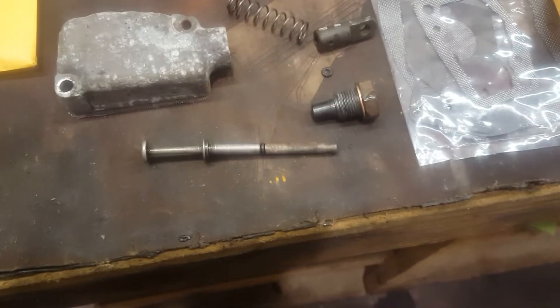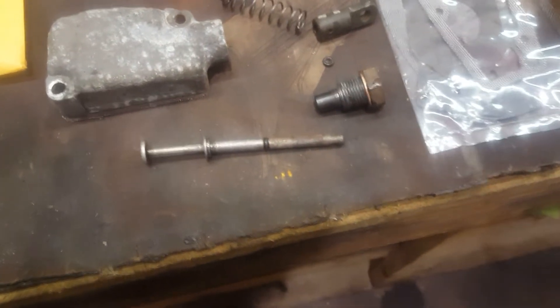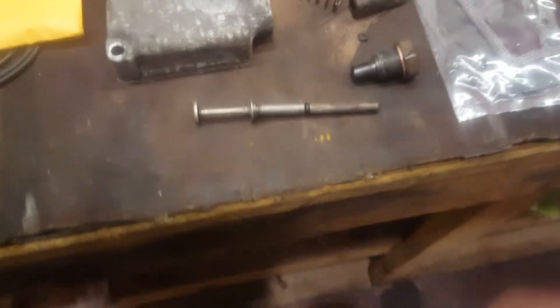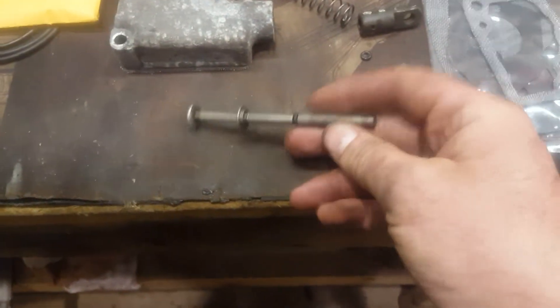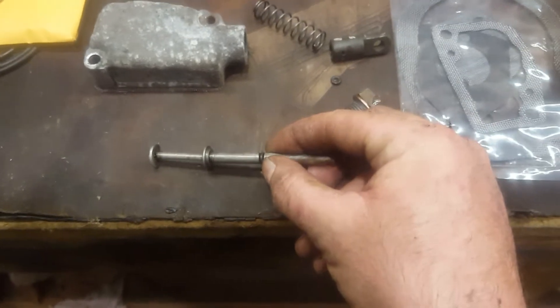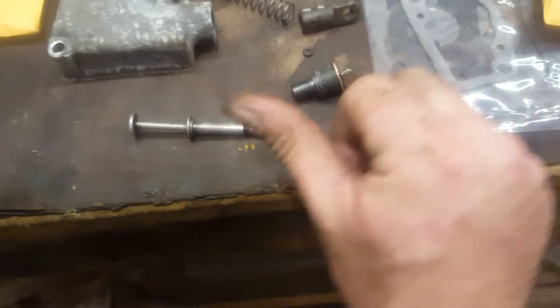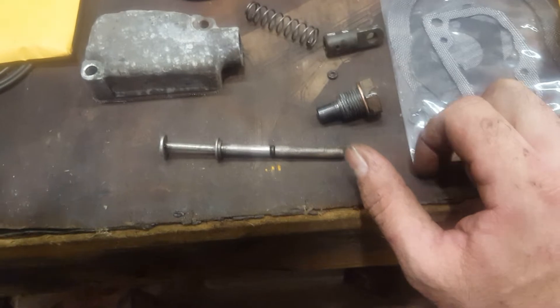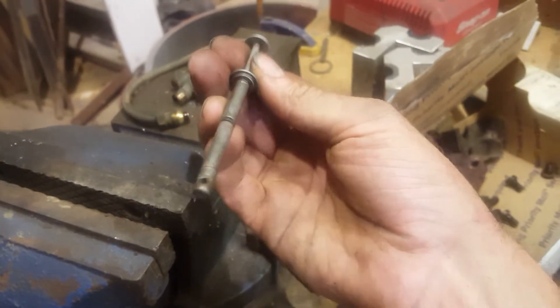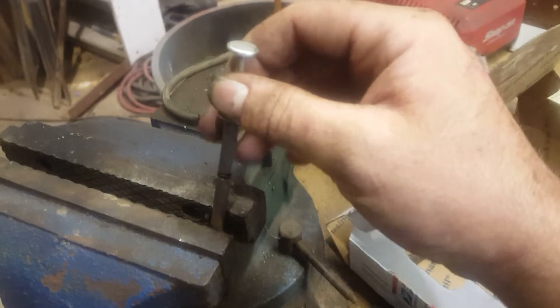The best way to fix a bend is just to replace it — this stuff is tight tolerance and you want to do it once and do it right. The other option is, because it's such a small piece of steel and it has this recess, they'll often bend right where the o-ring is since it's thinner there. You can use both thumbs and fingers to make minute adjustments by hand, or put it in a vise for leverage and just push on it gently.